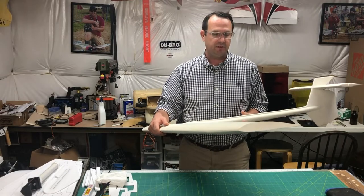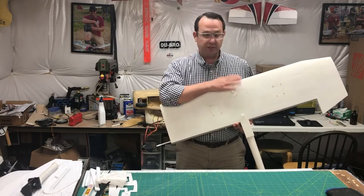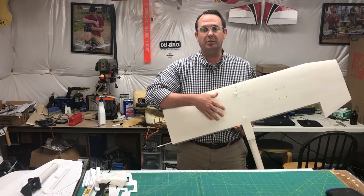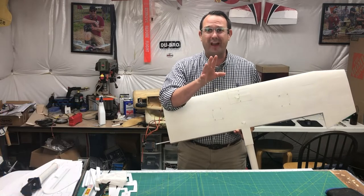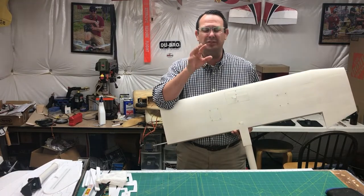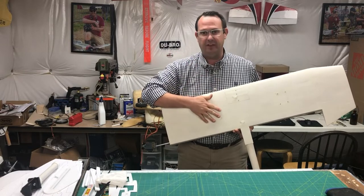So there's not a whole lot, again, visually to update you on, other than I've replaced all of the screws in the bottom with all the panels. I replaced those with RTL fastener screws. Just a lot easier to work with these. The other ones had like a 1.5 millimeter hex head button screw. They were so tiny and so easy to strip that I just didn't want to fiddle with them if I had to service this thing in the field.